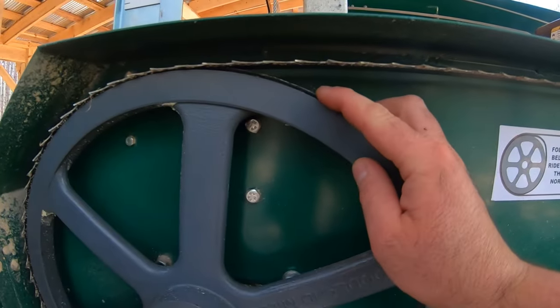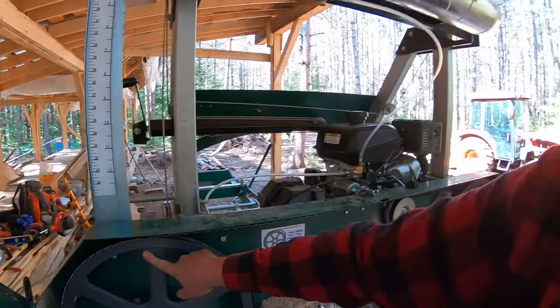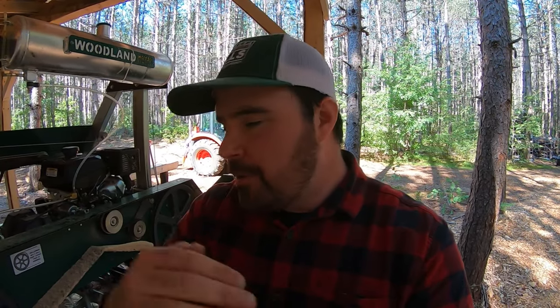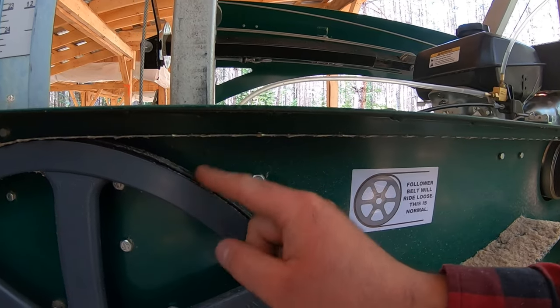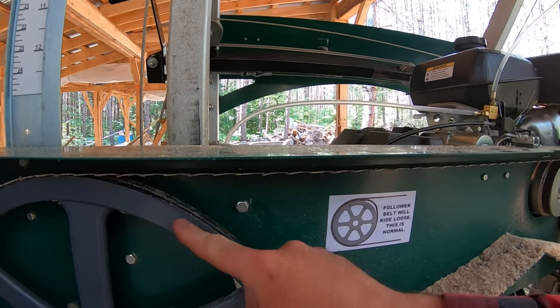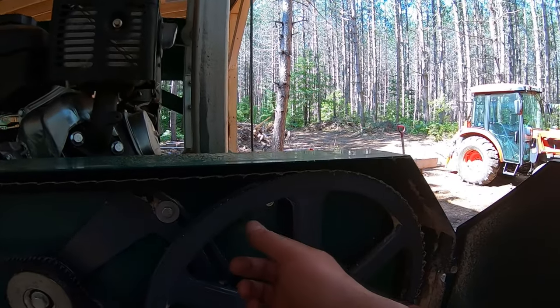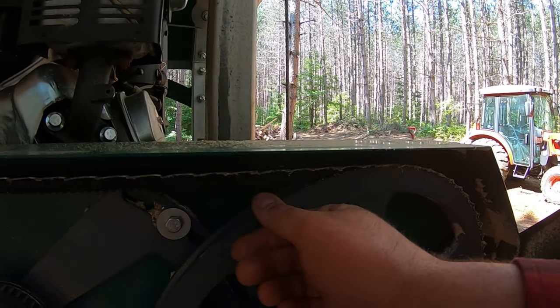Next, I'm going to make sure the blade is not sitting right on the steel band wheel. If it's sitting right on it, that has the potential for the blade to slide — steel blade on a steel band wheel will cause sliding and the blade will pop off. You need that rubber belt sitting just a little bit above the steel wheel so the blade is actually sitting on the rubber, not on the band wheel itself. When the belt sits down in that groove it should cause the blade to sit up just a little bit above the band wheel so there's no steel-on-steel contact. If it doesn't, your belts are probably worn out — get them changed.